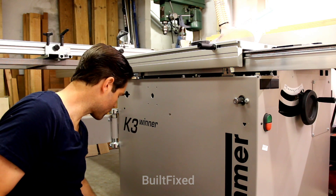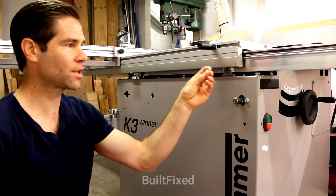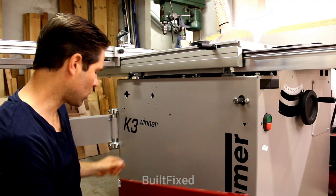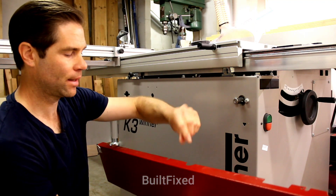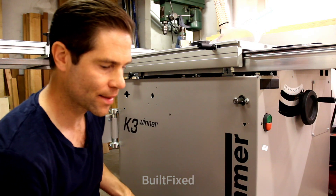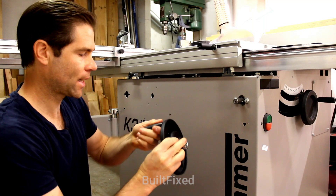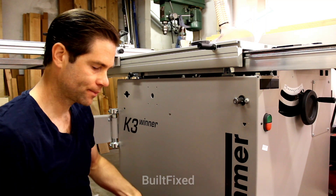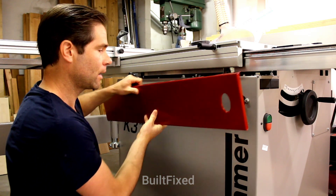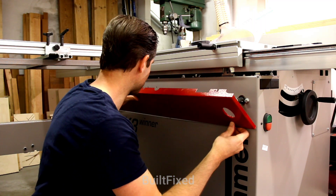Using the 10mm wrench, you can remove or loosen your bolts up on top. I wasn't careful enough and my washer slipped down in behind, so I had to remove this guard all the way — but it doesn't really matter. Start with your system hand wheel; maybe collapse the handle out of the way. Reinstall your sheet metal and take care that the metal ears fit down into all three slots.